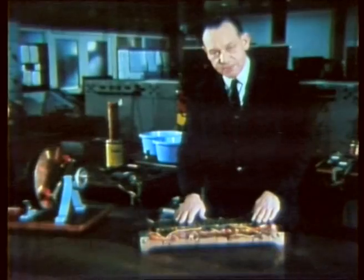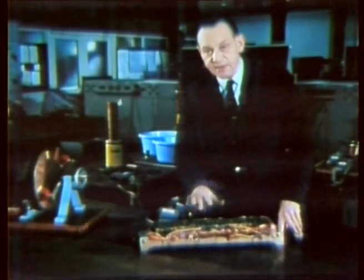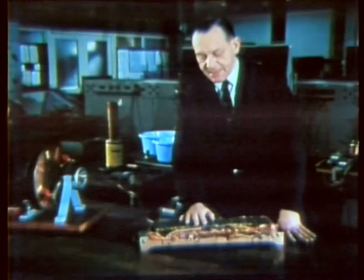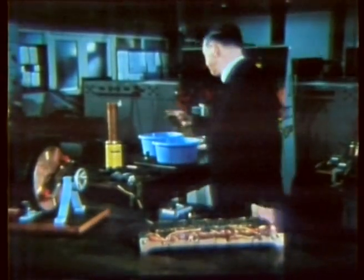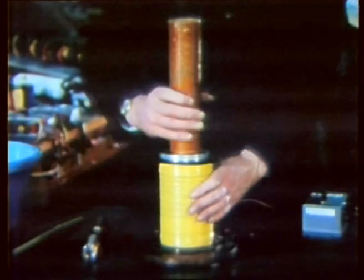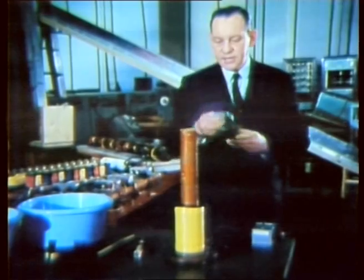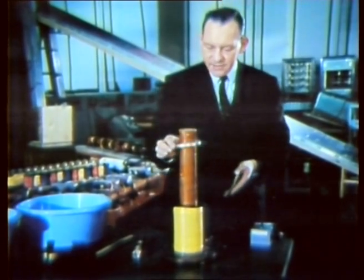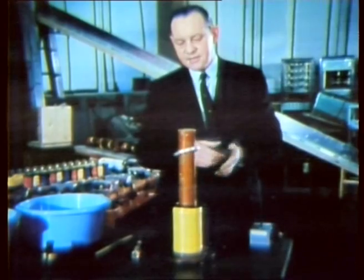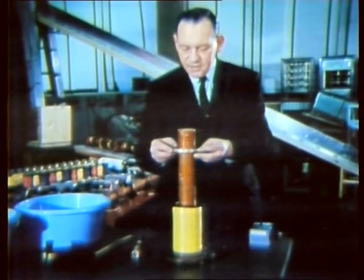This is the linear induction motor. It is easier to explain how the forces horizontally arise than is the case with the vertical forces or with the forces we saw supporting the sphere. But simpler still is a demonstration of induction using a single coil and a single ring like this. The ring is threaded over a steel core, which as you see is made up of a number of strips of steel — a bundle of iron wires will do just as well. When I switch on the alternating current, the ring is thrown in the air. Hold it down and release it, and it's again thrown in the air. But if I replace it whilst the current is still flowing, then it seems to float in the manner of the plate and the disc we saw earlier. And yet with this difference: it will never stay absolutely suspended in space — it always has to lean on the pillar.